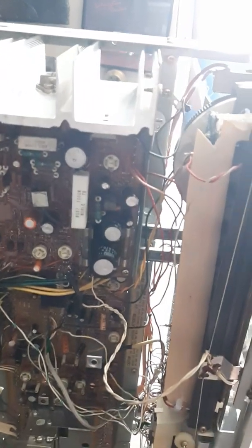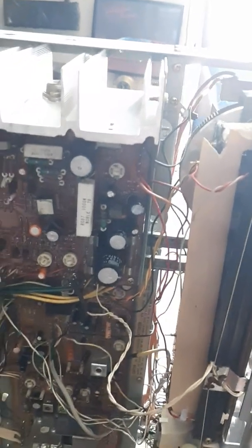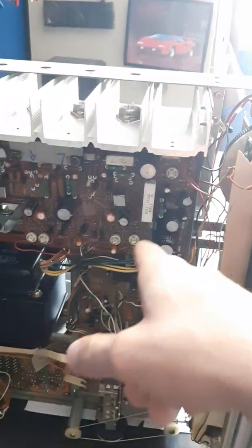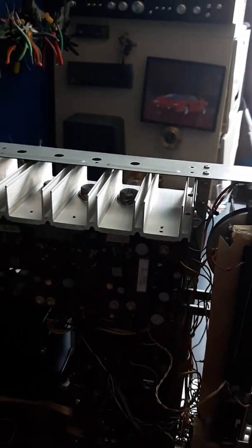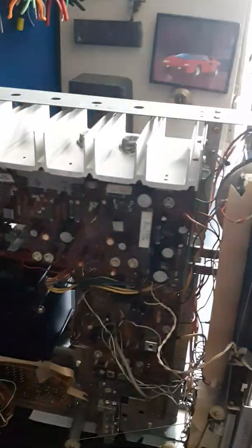That's where I noticed something was weird — it was set to about 20 volts, almost 50 percent of the voltage it was supposed to be. I think between that and the way these were regulated, that's what was causing the problem. Because the voltage was so low and the idle current was set improperly, it was probably causing the transistor to activate and then deactivate — turn on, turn off — and that's probably what was making those big crackling sounds.